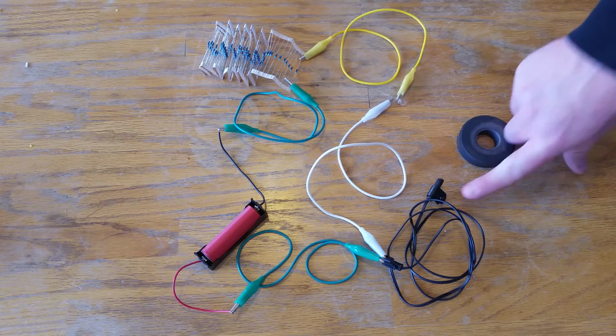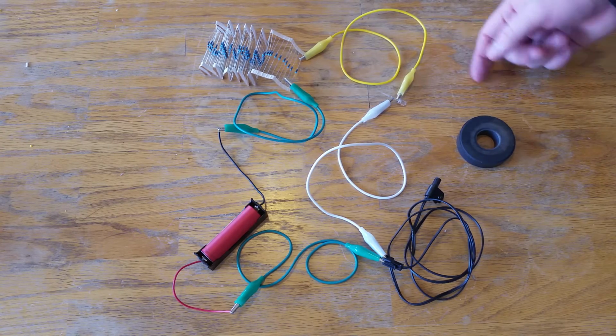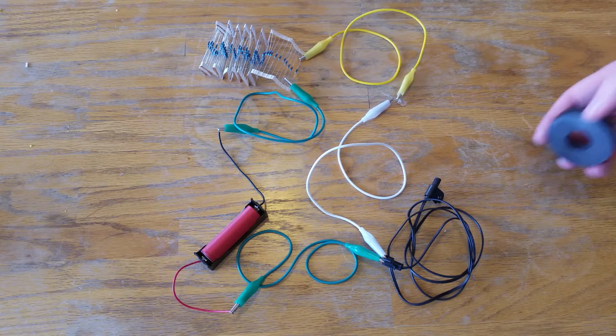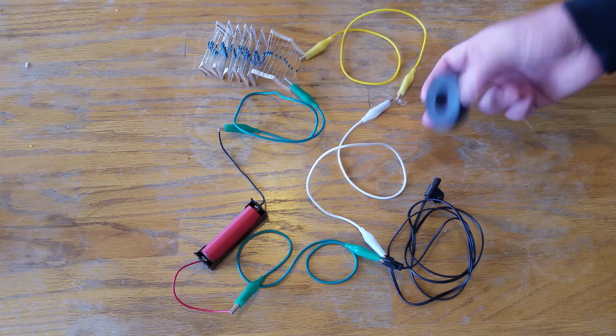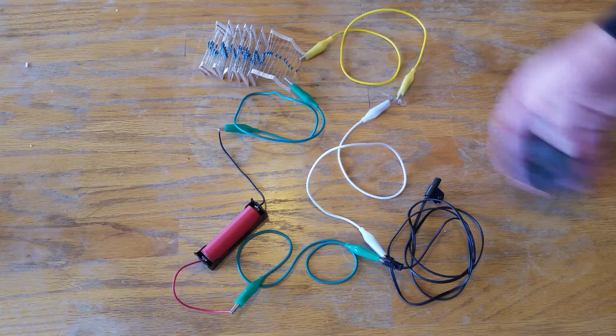Another one is a treadmill, which is where this thing came from, actually. The rotating part, the track on the treadmill, it's got a rotating cylinder on the end, which had a little magnet on it, which, as it came around, it would trigger this little switch. And the treadmill knew how fast you're running and how far you're running because of this little sensor.